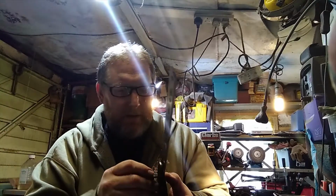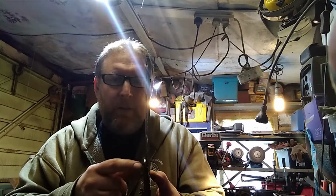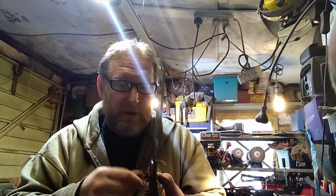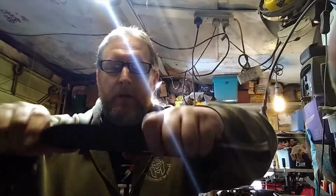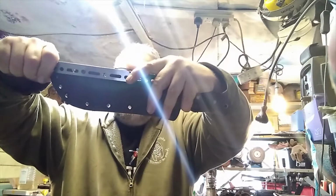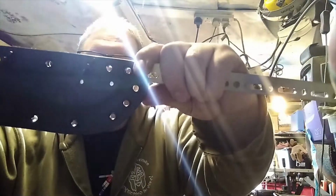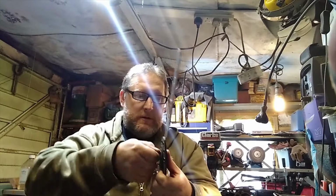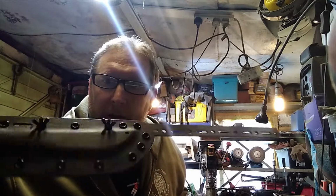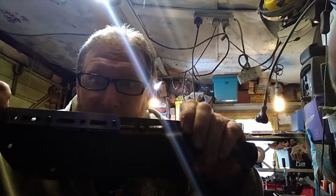I allow myself a little bit of play by having the bolt a fair bit thinner than it actually takes to go down the hole. So I can get a bit of a best fit going on. Like that. Now this hole is lined up with the back of that. That looks much neater. Nip it up, not too tight because you take all the paint off of the rivets. So that's what it looks like on the back, but the side that matters is this side.